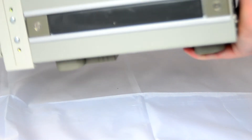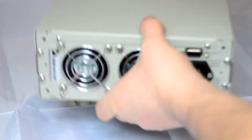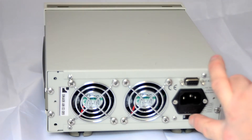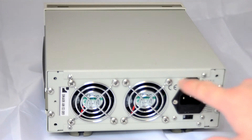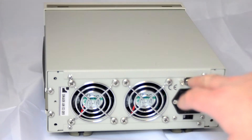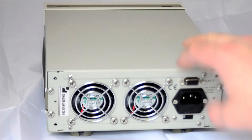Turning the unit around, you can see on both sides there's a handle — it's actually pretty sturdy but hard to pull out. So you've got carry handles on both sides. Looking at the rear of the unit, it's fairly simple: IEC mains input, switchable input power — I think it does 120 or 240 — and there's a TTL serial port. There's some software that comes with this, but to connect it to a PC you need an isolated TTL serial converter, since connecting your source ground to your computer ground is something you want to avoid.